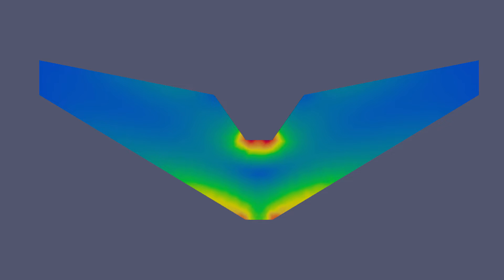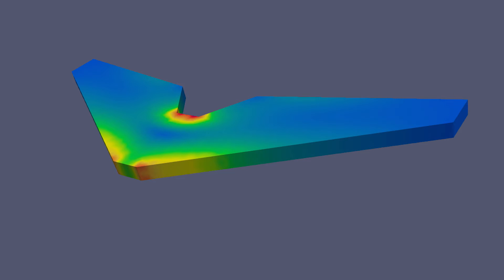If we take a look at a stress diagram of a wing with the forces applied, you can see right here at the nose we have a lot of stress concentration. But look back here where we have our cutout for our motor and prop — we have a very high stress concentration, and that's what is leading to all that cracking.